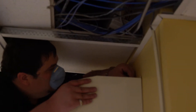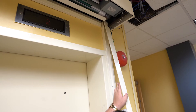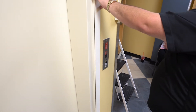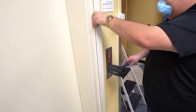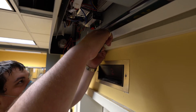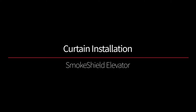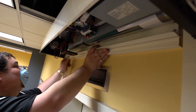Once the hood is installed, you can begin to install the face guides. Position the face guides onto the wall guides with the flare side on top. Use the non-marking rubber mallet to partially snap the face guides onto the wall guides, leaving a small section at the top unsnapped. Be careful to only strike the guides in this area so you do not cause damage. Next, remove the shipping bands — we recommend using snips for this, not a box cutter. Gently lower the curtain while making sure that the curtain and edge retention buttons thread into the guides.